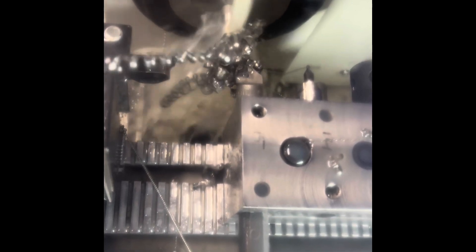If you notice our new subplate for our gang tooling, it has little slots built in it so that our tool holders can be repositioned in a specific location per part. You can take it off and put it back on and just touch off one tool or check one tool and set your offset off of that. With our old style we'd have to basically touch off all the tools and guess where we needed to be.